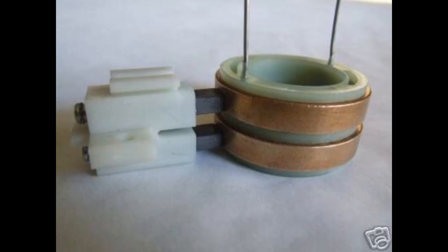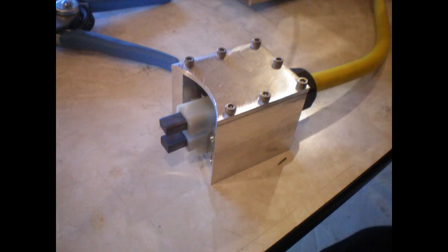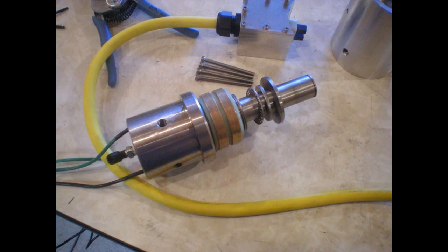This is the brush assembly that I ended up using. Because the alternator creates DC I only needed two wires, and what I did was machine a bunch of parts to make them adapt to the wind generator. Here you can see the brush holder that bolts to the assembled unit — it's all machined, two wires, just a heavier gauge wire that transmits power to the ground. Here's the other half of it with the thrust bearing and the other side of the brush assembly. You can also see the air line coming up through the bottom of the assembly for the air cylinder.